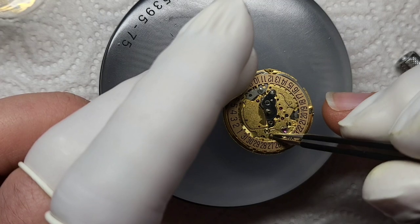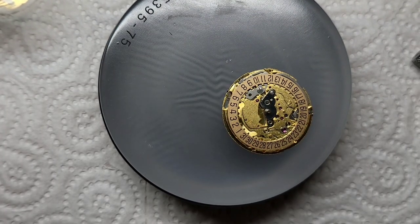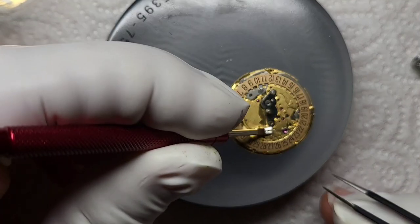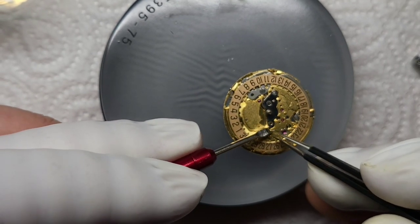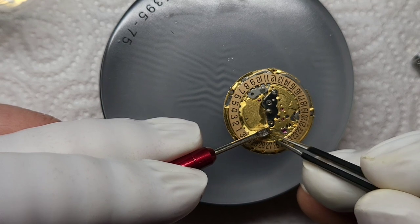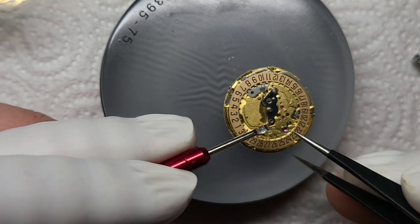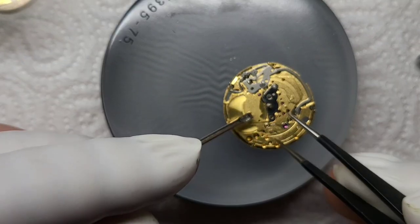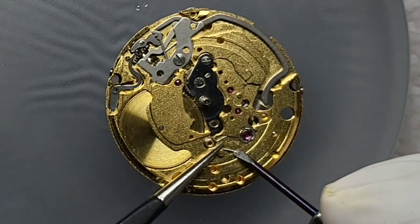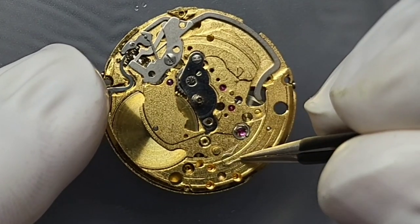I was very lucky — there's an index detent for the date wheel there and as I knocked it, it actually became detached. I was very fortunate that the spring hadn't gone flying too far. It's another thing I've noticed — the difference between a wristwatch and a pocket watch. It seems that wristwatches are absolutely jam-packed full of springs. Here you can see me trying to release that particular spring without it sending itself into next week.